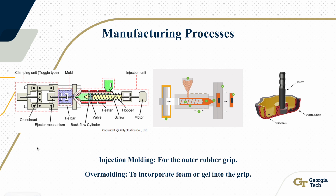For manufacturing, several processes will be used to ensure both durability and comfort. First, injection molding will be used for the outer silicone shell, making it weather resistant and comfortable on the hands. This process is ideal for creating complex shapes with high precision and is cost effective for mass production. Next, over molding will be used to incorporate the foam and gel layer inside the grip, combining the two materials into one seamless part, ensuring the foam and gel are bonded securely within the outer shell for shock absorption, so that bumps during rides don't adversely affect the user.